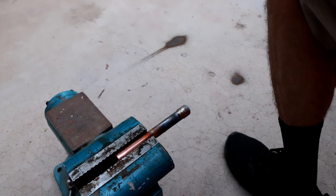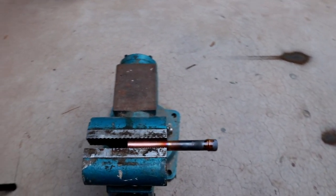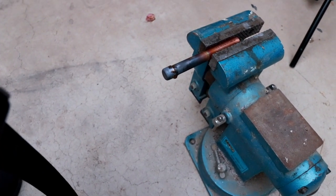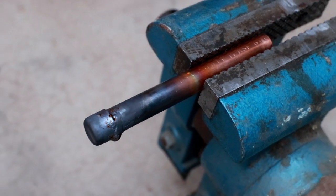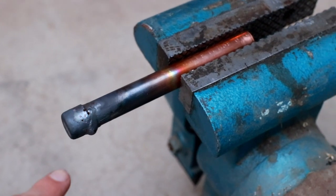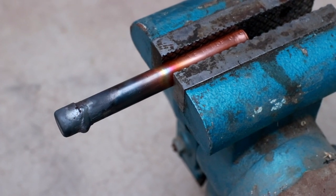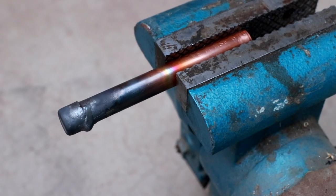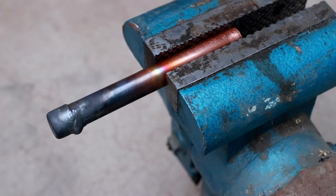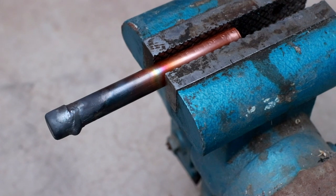That time it did make it all the way around, but it wasn't very clean. The pipe has a big glob of material right there — it is fully joined and doesn't seem to have any porosity, but it's not a super high quality joint. This indicates that although standard brazing with full access is fairly trivial, brazing in confined spaces is much more challenging and could potentially lead to reduced reliability of the joint. We're going to have to take particularly special care when brazing in a confined space.